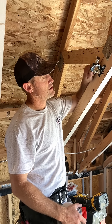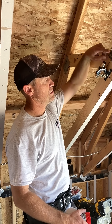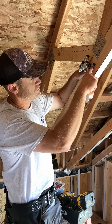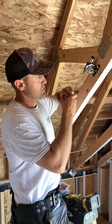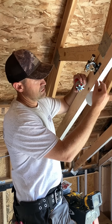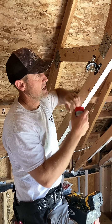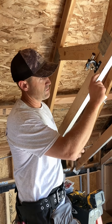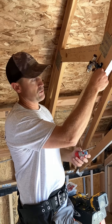This right here is where you connect your PEX — your PEX takes off from here. This is the actual mounting bracket that goes on here; you anchor that off with three screws. This goes to your truss. You're going to measure down to where you have the right distance for your drywall. We've already done that here — measured about an inch and a half from the bottom of the truss to the bottom of this bracket.